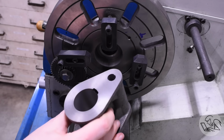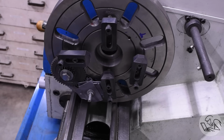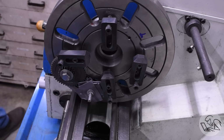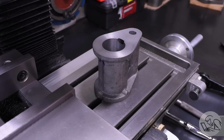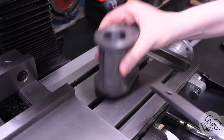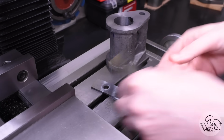The takeaway here then is if you can understand your own cognitive weaknesses, it really helps you prevent errors. In my case, knowing this about myself, struggling with number transposition like that, I do layout marks and other double checks a lot, as you see on my channel. And in this case, that layout line kept me from scrapping this part entirely.